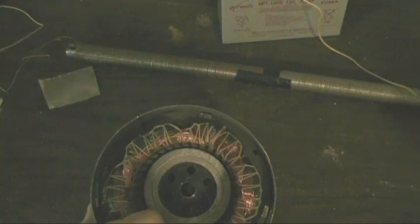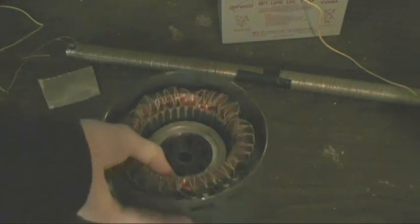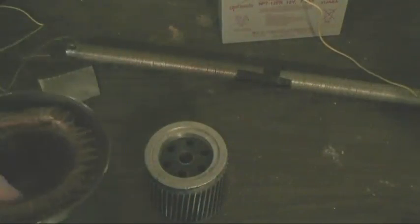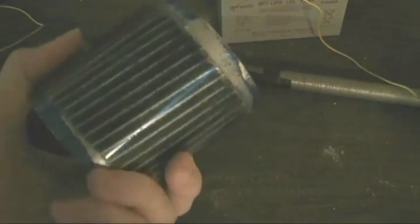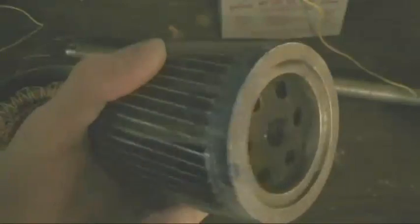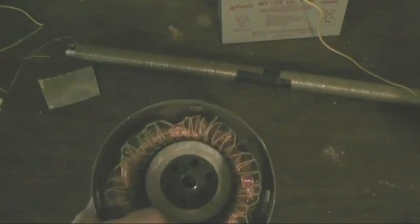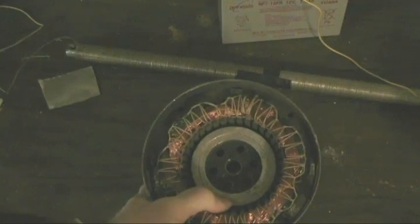The induction motor has two parts, the rotor and the stator. So let's separate them. This would be the stator core, and again, it's many electromagnets and many stacks of steel sheets. This is a rotor, which is usually aluminum, and has, again, stacks of it. Don't know if you can see those lines in there. Alright, but that's the rotor. And that entire assembly there would be the induction motor, and it would have a shaft moving through the middle of it.